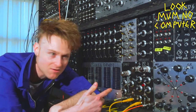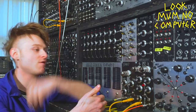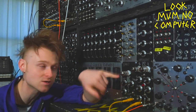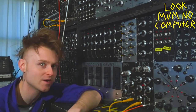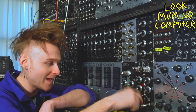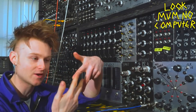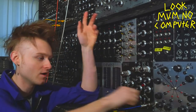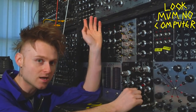As you can tell, it doesn't sound like any old distortion — it sounds like a proper muffled up, weird, crazy thing. You can actually feedback these on themselves and they can sort of become an oscillator. So now instead of a signal going through, I've put the output and input into a multiple so they're both connected together, then connected to another multiple for the output audio. And now when I turn it up, it acts like an oscillator.